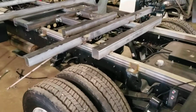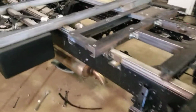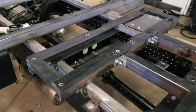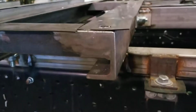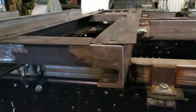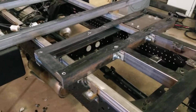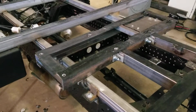and protect it. Now all of this is stainless steel square tubing frame, with the exception of what the engine's going to sit on. And the engine's going to sit on this 2x3 heavy duty rail car frame. As you can see, that's very heavy duty metal. It's 3/8 thick. To give you an idea, our original Pringles, the rear mount was a 1/4 inch thick channel.